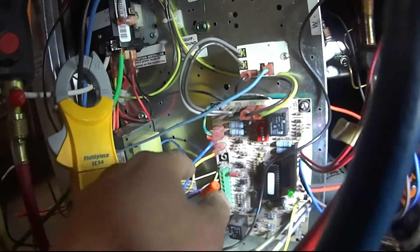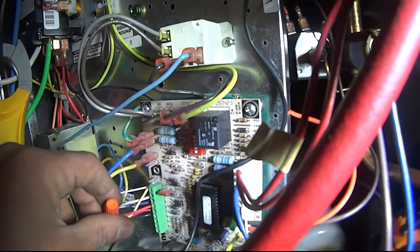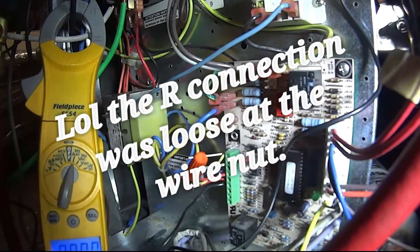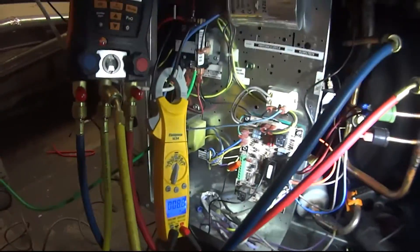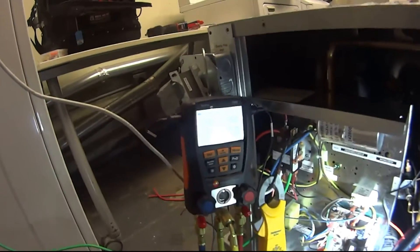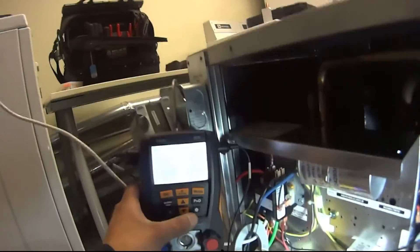Alright, so I got it just connected straight to the contactor, and I got my wires connected — Y, fan, reversing valve, and R. Seems like it's connected. Okay, so let's see — we're actually starting now. Take a look at the amperage. I might have to open it up a little bit more. Do me a favor, stay by that valve that I got cracked. She's looking good actually — wait one second. I don't know if you guys can see that, let me shut off the light.